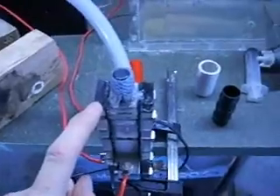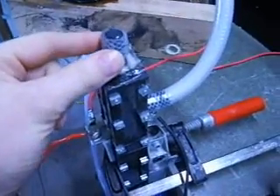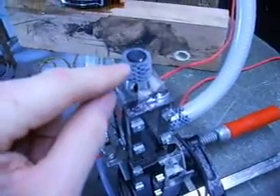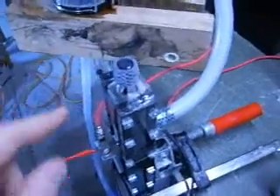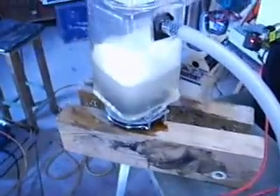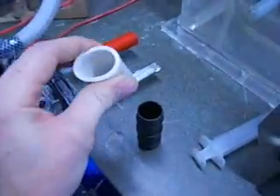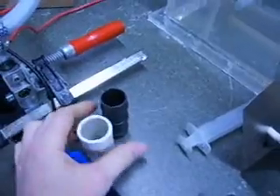I've been using this method to cap off the unused connectors here, and it's been working really well. This is just another version of a blowout valve — just using one of these pipe connectors with a bit of hose and a bit of plastic. I've tested that on the top and the bottom; it doesn't leak and it didn't change the gas production, so I know it's sealed up and working properly. On my new container, I'm going to have a bigger one of these in the top with a larger bit of piping going over the top with a bit of plastic, and that will be my safety blowout valve.